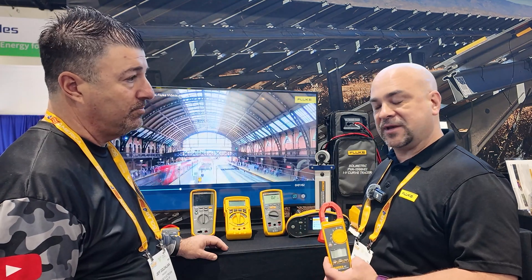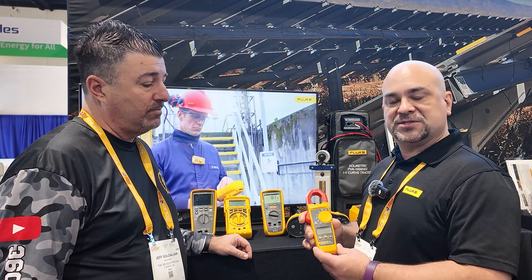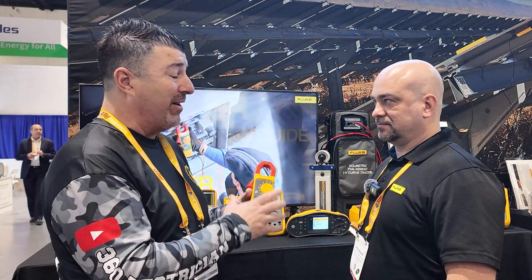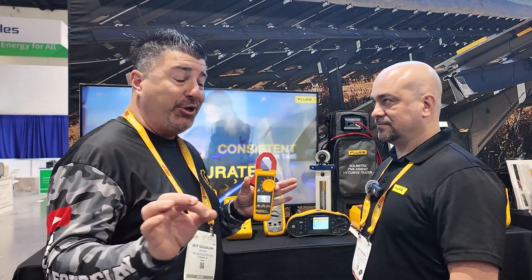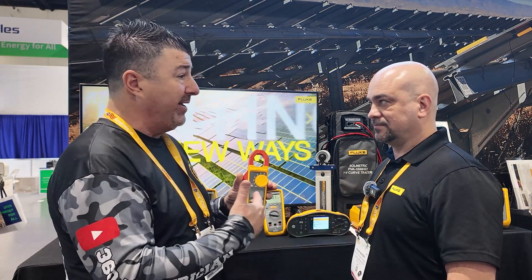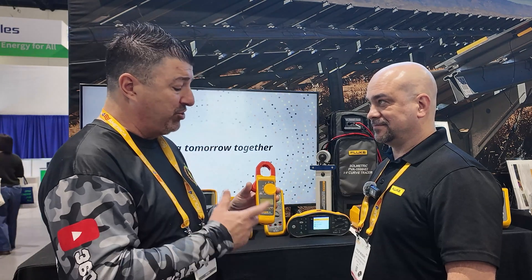You could be a 360 company if you think a little bigger. This would be a great starting point for being very safe and comfortable with just about anything you're going to run into with a set of leads. A couple of things to mention - industrial grade for sure, the plastics. The thing I like about this meter and why it's my go-to: it's super clean, 400 amp clamp meter. Most other brands are only going to give you 200 in this form factor. That's huge. This tool lasts you longer in your toolkit where you don't need to upgrade right away.